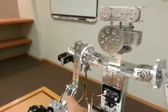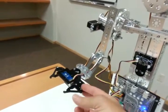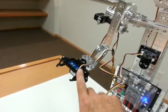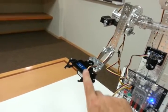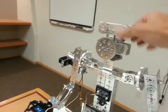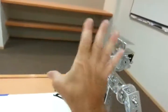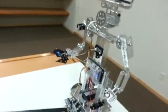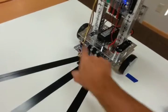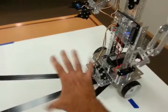It's got one servo here on the shoulder, so the arm will move up and down. It's got another servo here on the gripper to open and close the gripper. You'll also notice another sensor I've mounted here on top of the gripper — that is a color sensor. We also have a pivoting head, so the head has a geared servo attached, and the head will move left and right. This other arm is just free swinging, and it's driven by two DC motors, and then an omni wheel on the front and the back, so it will pivot back and forth nicely.